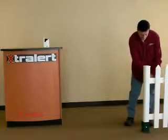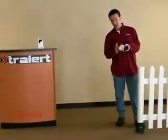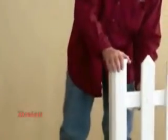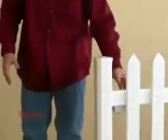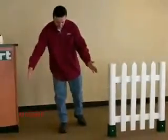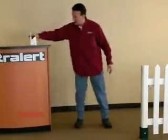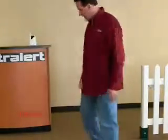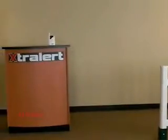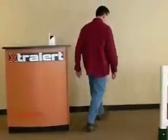But what I'm going to do now is, instead of positioning the sensor straight across, which we normally do not recommend, I'm going to put a slight tip in it. And what I'm actually going to do is tip it fairly steep. So you could literally use this to control, say, a 3 foot wide area for drive-throughs and coffee shops, anything like that. We could actually set it up now. As you'll see, I'll walk through it, and again, it should trigger. But if I take a few steps over and walk over here, you'll notice it doesn't go off as it would if it was tipped straight across. It may not even if I stay tight. Yeah, it didn't go off.